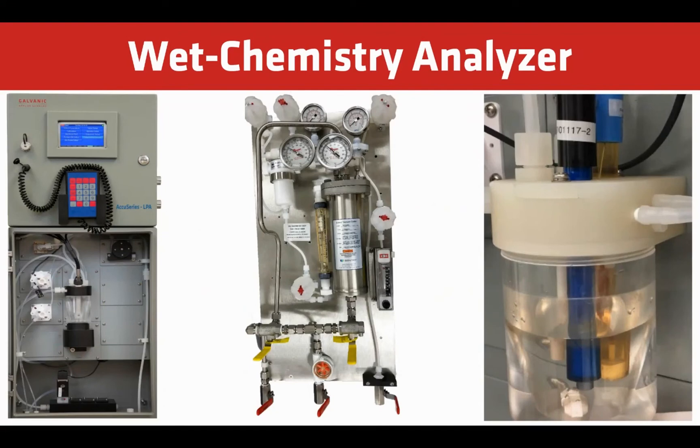The best way to avoid these issues is to simply employ online measurement. Continuously monitoring wastewater chemistry improves the stripper efficiency, increases energy savings, and ensures environmental compliance is maintained. Process analyzers provide the required feedback to optimize steam injection and pH adjustment to avoid over-stripping. Sample conditioning is available to regulate the sample and minimize maintenance. Multi-parameter configurations are available to measure multiple compounds using one analyzer, such as H2S and ammonia.